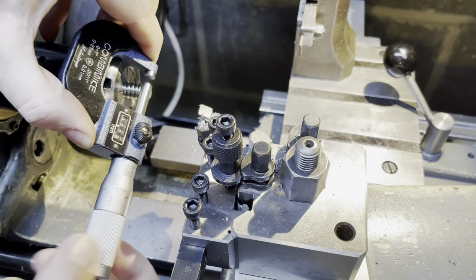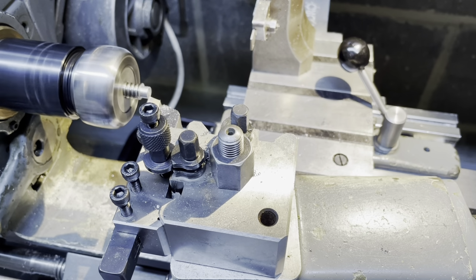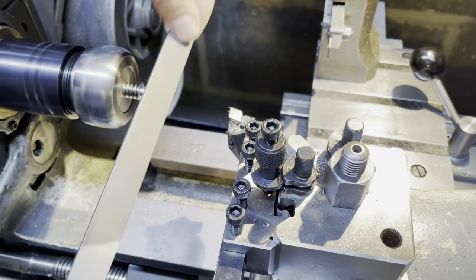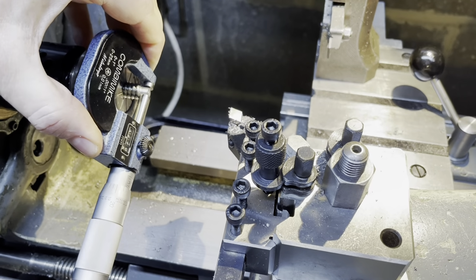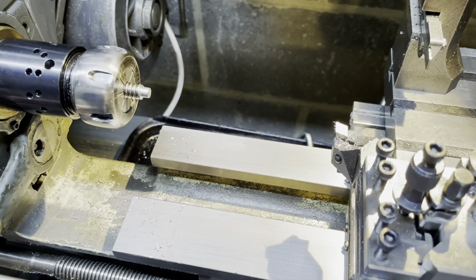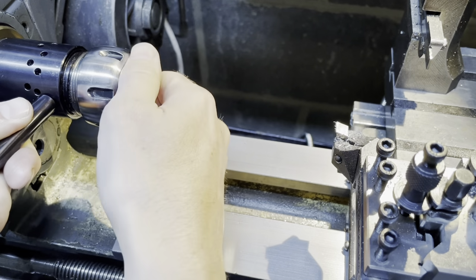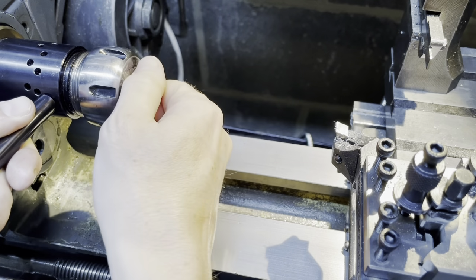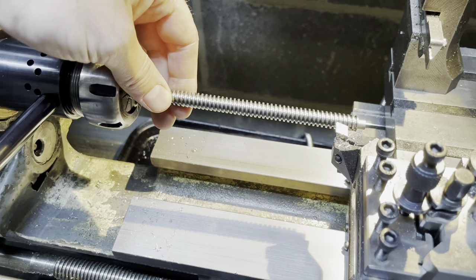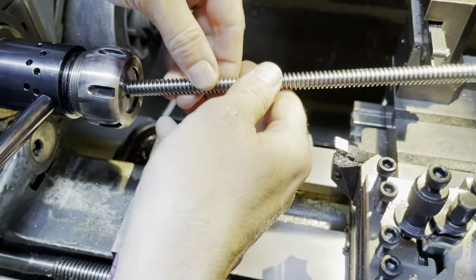Let's set up the DRO. Going to aim for 1/4 inch. That's probably what I aimed for on the other end, so that's a good second. So the other end's going to go into the part we're going to make. Therefore, I want 3/4 inside the part. So I'm going to make this flat area 1 inch long. That would give me 1/4 inch sticking out between the part, and let's put the diagram.